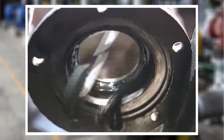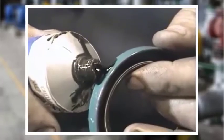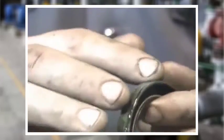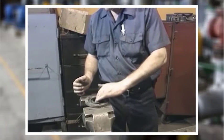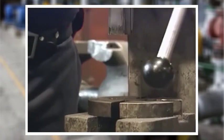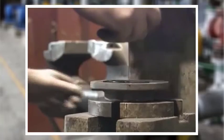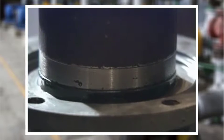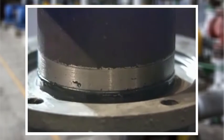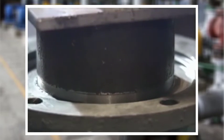Because the seal will probably leak, clean the seal cage thoroughly and remove any gasketing material. Some manufacturers specify a sealing compound for coating the seal prior to installation; follow the manufacturer's instructions. Then place the seal squarely in the seal cage with the garter spring on the side of the cage that will be toward the bearing. Press or tap the seal into place by using a cylindrical tool that applies pressure evenly around the circumference of the seal case. Pressing or tapping directly on any small portion of the seal case will distort it, damaging the seal and almost certainly causing a leak once it is reinstalled.